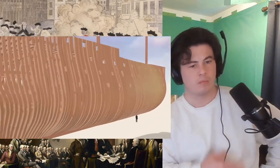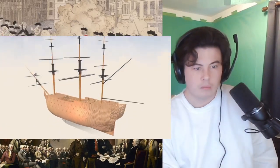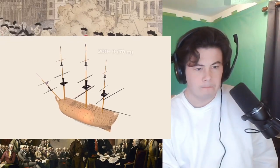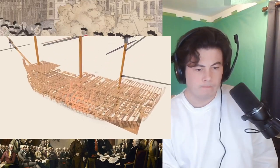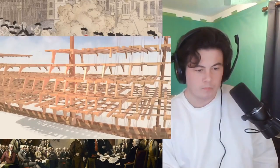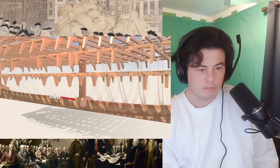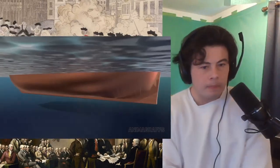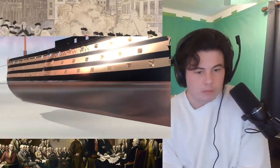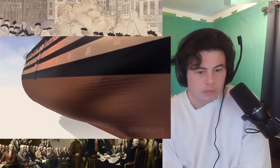At the waterline, the hull is nearly two feet thick — it's a floating tank clad in wooden armor. The masts, the tallest of which tower some 200-plus feet above the water level, are supported at each floor as they extend to the massive keel beam at the ship's very bottom, where they're anchored with large wooden blocks called steps. Makes sense to have them all the way down there. At the exterior, the hull below the waterline is covered with copper plating to protect against harmful marine growth and for improved water tightness.